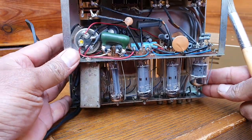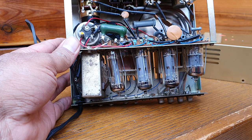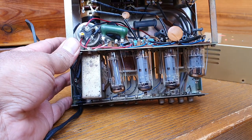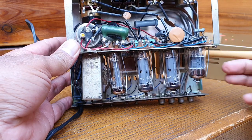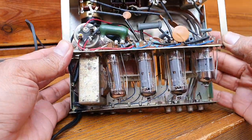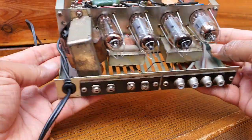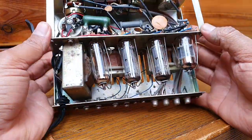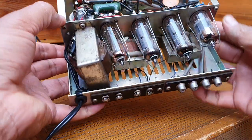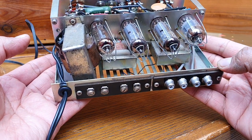You can see the technology of the 60s and how simple it was. The potentiometers — variable resistors — are high quality and they look good. The switches also look good. I'm quite surprised it looks quite clean from inside. The tubes also look like they have not been used much. Tubes are okay. If those electrolytic capacitors are replaced as I mentioned, then this can be a nice little amplifier generating a couple of watts of warm tube sound.